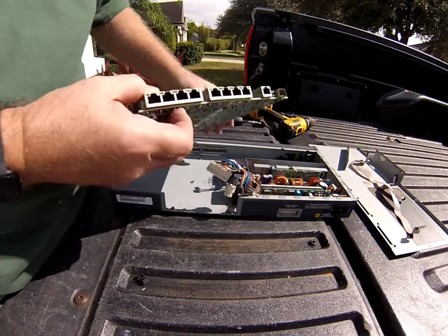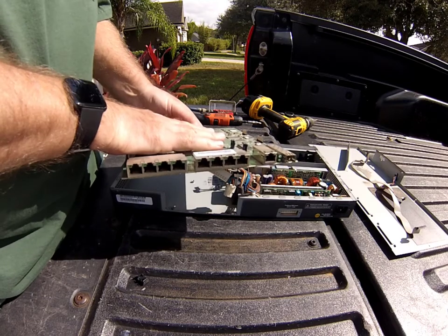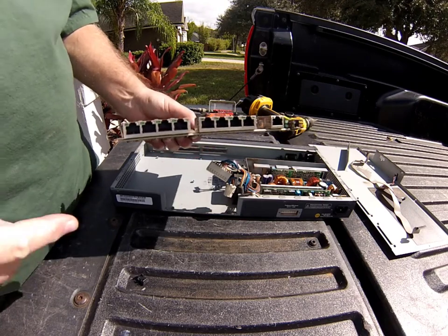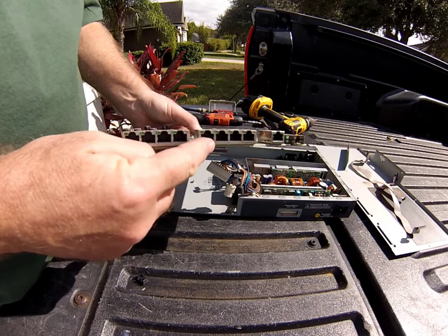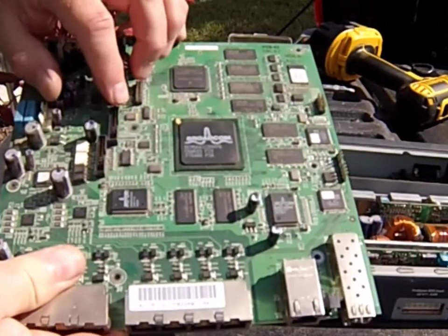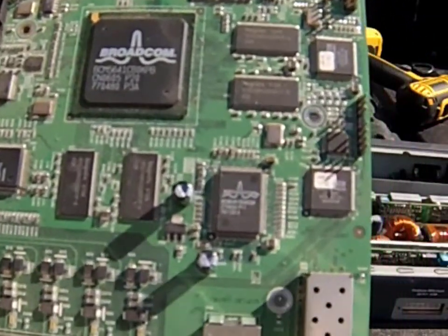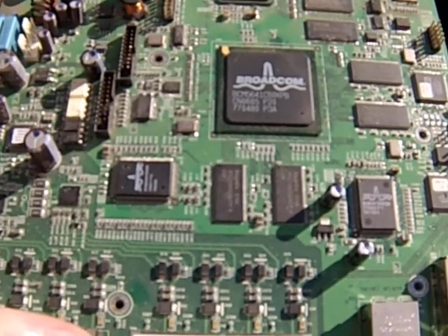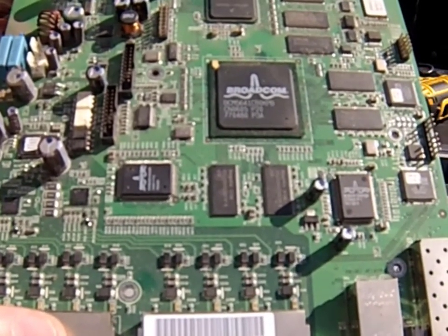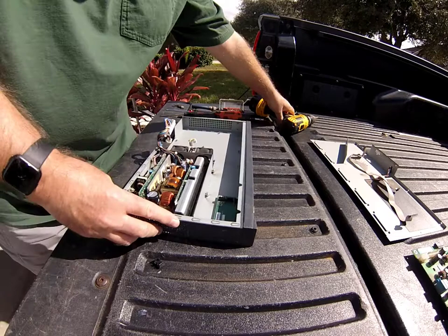The question becomes: these gold-plated pins inside the connectors — do I pull off the connectors to guarantee the gold? I'm pretty sure my yard will take this as a high-grade even with those connectors. So do I want to mess around pulling off the connectors to get at those gold pins? What I'll very likely do is pull off the gold-edged oscillators, because as I showed in an earlier video, there is some serious gold inside those. Pulling those won't degrade the board at all, and with the MLCCs from the other side removed, this will still be a nice high-grade board.